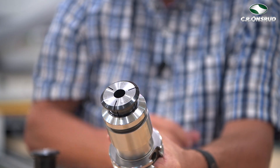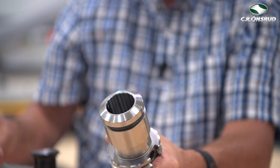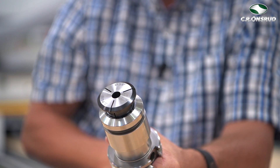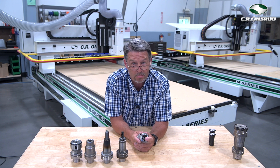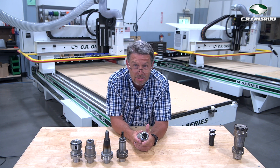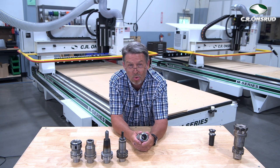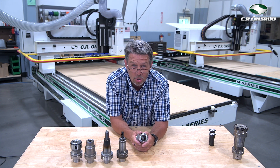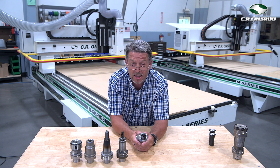As you can see, each of these collets will fit into this holder. Some disadvantages are the initial cost and it requires specialty equipment for changing the tool. This tool holder is also recommended when high grip strength is needed, such as in phenolic machining or when low runout is required, for multi-flute tools, extremely small diameter tools, and obtaining better sidewall finish.